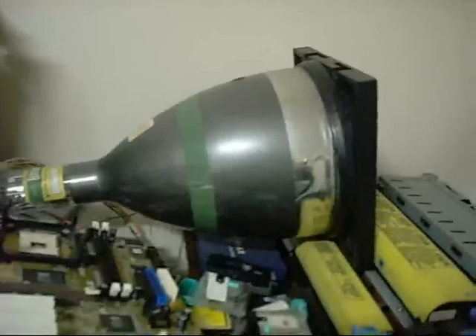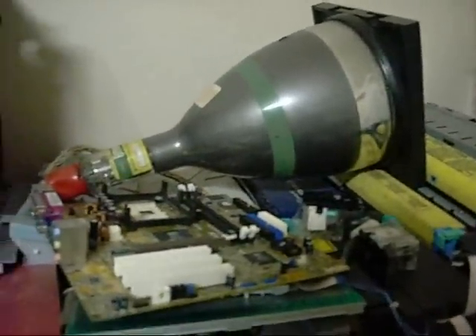The main thing to remember when working on televisions is that the tubes are a capacitor and they do store very high voltage. They typically run from 25,000 up to 35,000 volts depending on how big the set is. It's dangerous all the way from around the transformer on those wires, all the way up to the tube around the anode. So don't touch any of that unless you've discharged it first — and I'm going to show you how to do that shortly. This applies for any cathode ray tube, even something like an old oscilloscope tube.